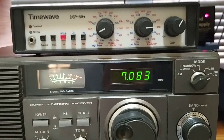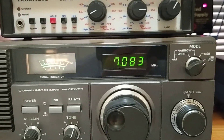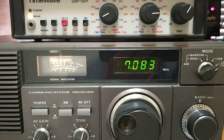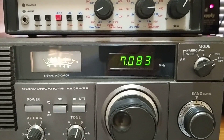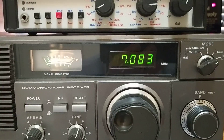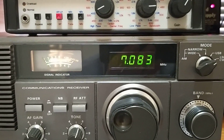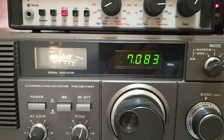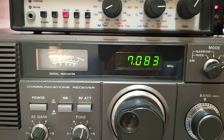I've got it set at the moment using the upper and lower cutoffs on the DSP, and I set the bandwidth to about 2.8 and then down to 400. So that's 2.4, which is a sort of standard SSB bandwidth on most radios.